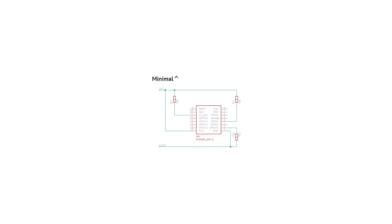It is true that we need to pull this pin high for the ESP to operate, but many of the newer ESP8266 modules have a pull-up resistor under the hood, or the metal shield at least. This is contradictory to what we see in the diagram, and as a consequence, we see many makers are not aware of this, and still add their own 10K resistor.